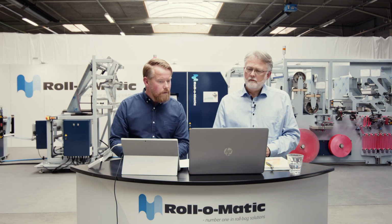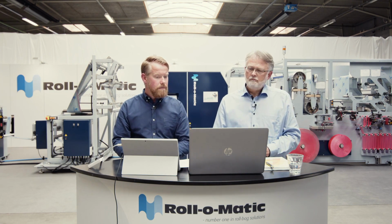Then there's a question on what Teflon tapes we're using. I guess you're thinking about for making the hem seal. It is a Teflon tape that we have manufactured to our specification. So I can't really give a specification for it. I can mention the lifetime on the Teflon tape would normally be between 2 and 4 weeks in regular production.